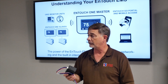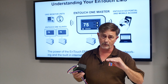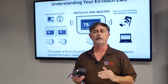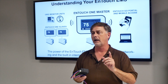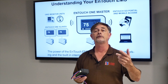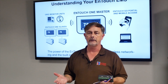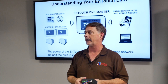If you track and trend this, then you can see — according to your KW usage — if maybe you're using power when you shouldn't be. Because you see it real time, time of day, it even associates power load occupied versus unoccupied. I call this poor man's analytics, because today it's all about energy, it's all about knowing, it's all about analytics.